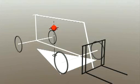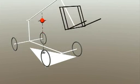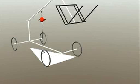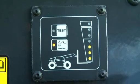Because the Versa handler has moving parts, the center of gravity moves as the boom moves forward or backward, up and down, or even when the forks or other attachments are tilted forward and backward. This is true whether loaded or unloaded. The telescopic handler has a device which alerts the operator on the load moment.